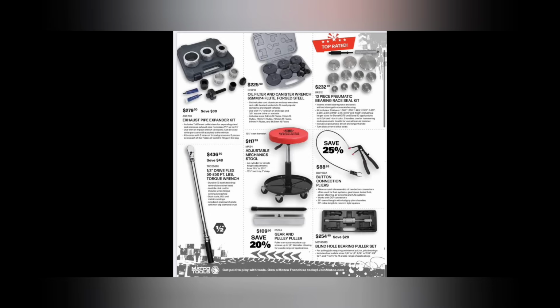That is not good. If you're driving in seals, you want to use your steel face with the rubber seals. That's okay, but using an aluminum one on your bearings, not good. You're just asking for an explosion. You ever seen a bearing explosion? If you're pounding on one, you'd know. It's like dynamite going off.